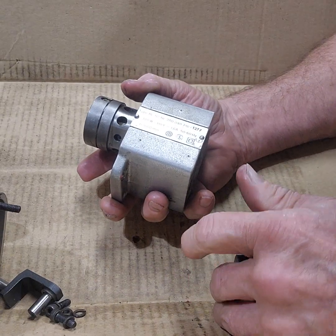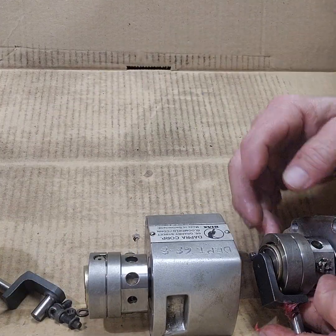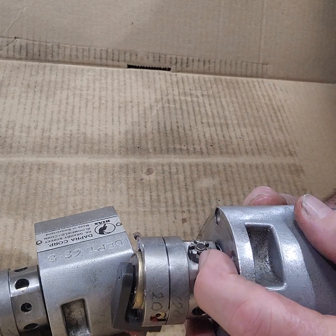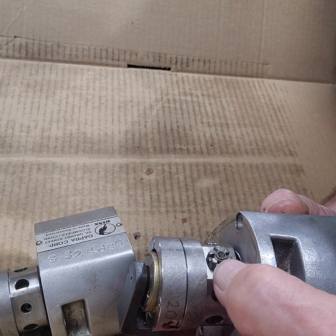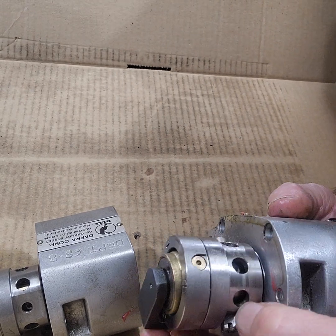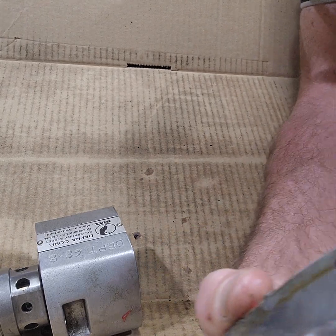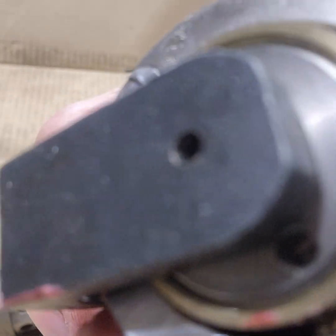So I'll tell you how to take this apart — I've never had one of these apart. This little nut right here has a 1/16th roll pin in it, and it keeps the tension on that so you can turn it and adjust it. So what you've got to do is drive the 1/16th roll pin out of this, take this nut off, unthread this out of a bronze nut that's inside this. Then you take these three screws — there are three screws holding a cap on. They're straight slotted flathead screws.